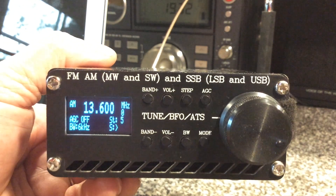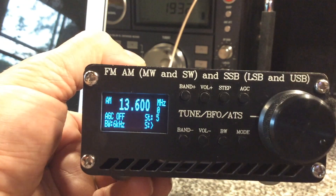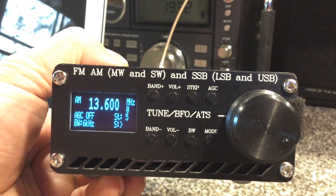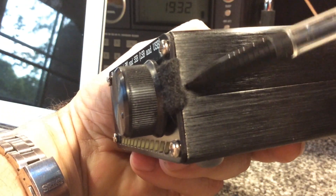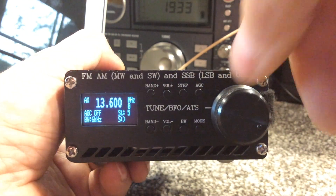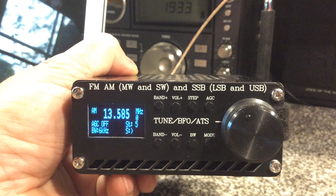One thing this radio needs is a new encoder. The encoder wheel wobbles — you can see that — it's really loose. The only way mine would work was if I pushed the encoder wheel to one side. If I kept it perfectly centered, it wouldn't even pulse. So what I did was put a piece of felt inside the case wrapped around to the back of the knob. You can hardly see it, but it really fixed the problem — it tilts the wheel just slightly to the side and it actually works now. It's a weird fix, but it was what we needed to do.